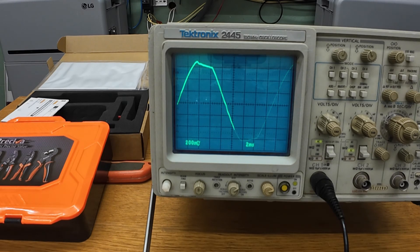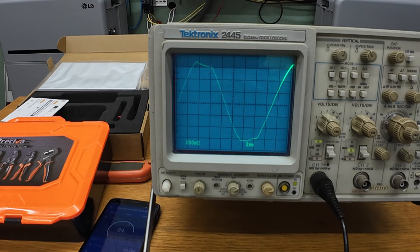See what the smart shunt says. Still holding 6 kilowatts. Smart shunt says also 130 amps on the battery. Power is 6,633 watts. 38 minutes to empty, and the battery says 46 minutes to empty. Converter says we're down to 237 volts, 130 amps, 6 kilowatts.